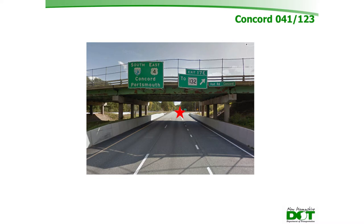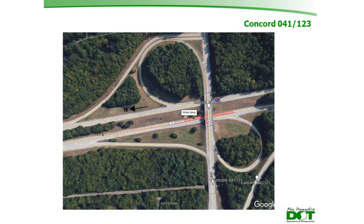The impact occurred in the middle lanes of the three-lane I-93 section, where the right lane serves as a ramp onto White Road. A traffic control plan was developed and presented to the front office. A portion of the work required closing that ramp, necessitating a signed detour routing traffic to another ramp. Traffic volumes also dictated work hours — crews went out at 9 a.m. after the morning rush and worked into the afternoon.